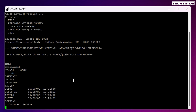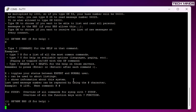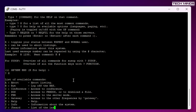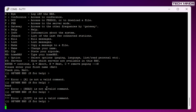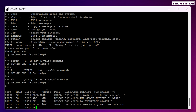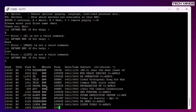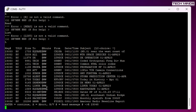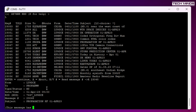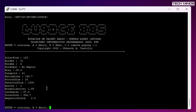We can either wait for the beacon to appear or try to connect directly. Before connecting, I want to make sure the Tiny2 has retained its settings after the battery change. I previously set my call sign using the MYCALL command, so I'll type that in and hit enter — it should now show me the programmed call sign. If we type the connect command — connect GB7MNK — the Tiny2 will transmit the required packet using the FTM300. If GB7MNK receives this connection request, it will send the connected state, and you'll also see the CON light on the front of the Tiny2 illuminate to show that you're connected.